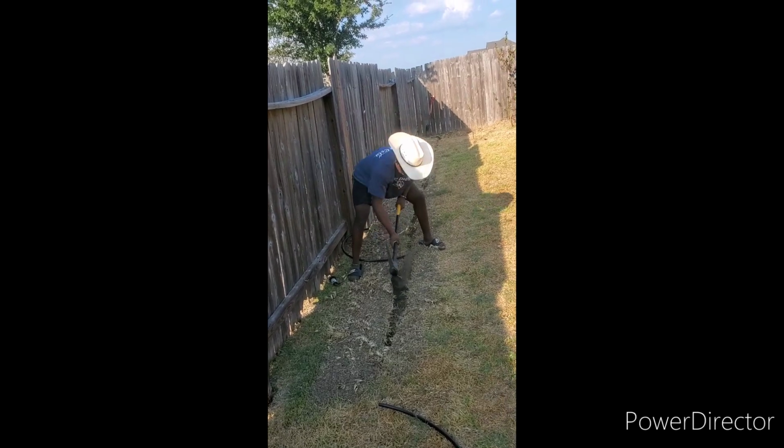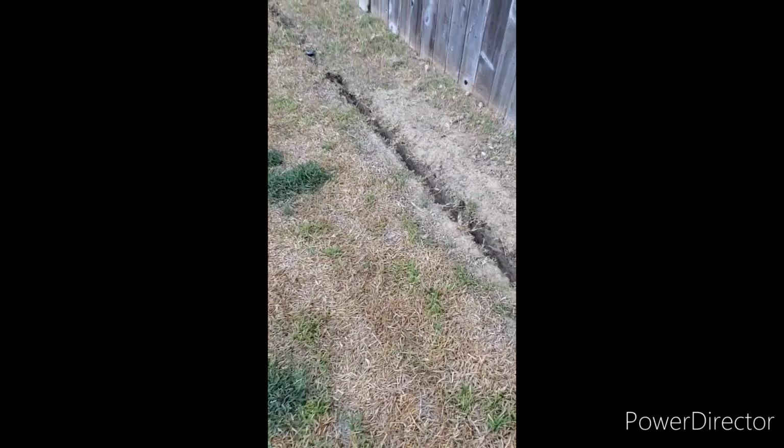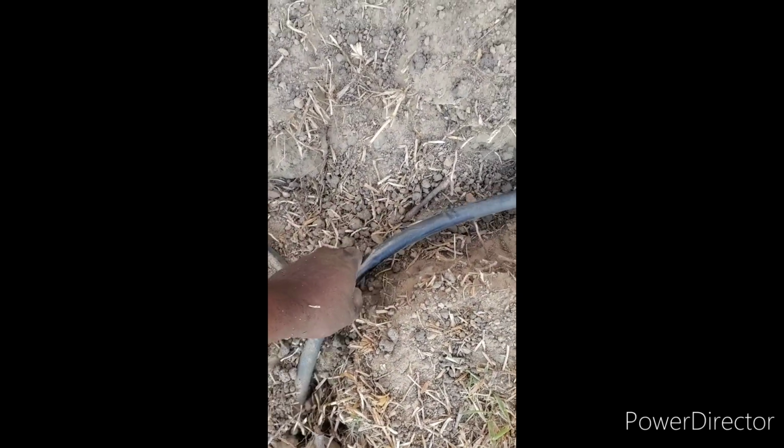Child labor. All right, y'all. So just to give you an update on where we are right now. Got my sprinkler heads put in down here. Already got them buried, and I got them buried to ground height, so make sure the lawnmower doesn't hit them. I got my son filling in the ravine down there. So this is gonna be channel 1, going this way. I didn't L these because, as you can see, it's a nice, easy bend. It's not a real tight curve, so I didn't L these out. I just left them and let them bend. It shouldn't cause too much damage, and I'll probably break that down a little bit right there, but they're just going real nice and fluid.